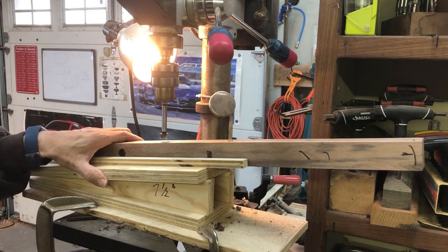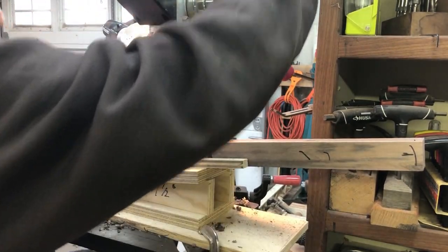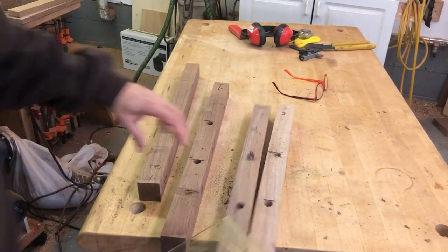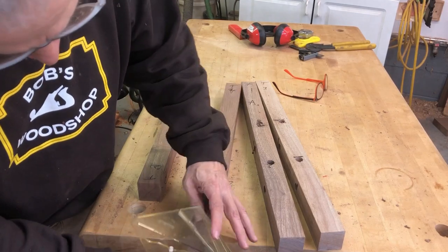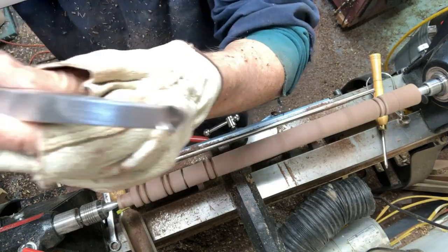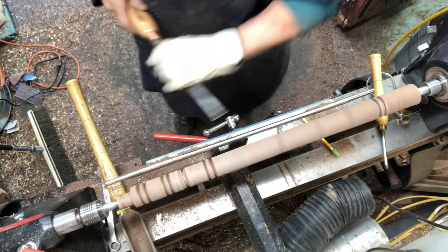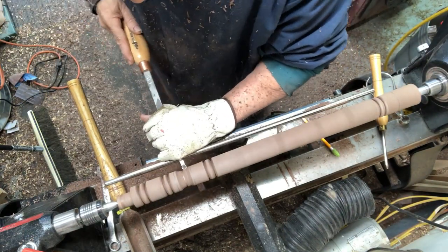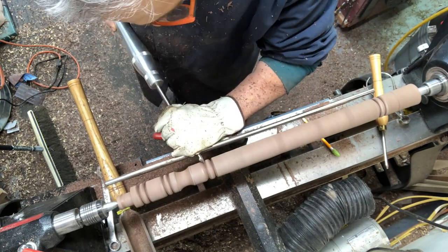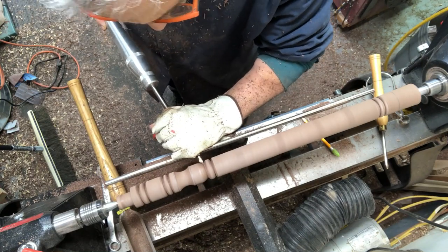Here's a little more of the same at a different angle. The use of a fixture like this is just the way to go — you get a lot more accuracy. The next step is to mark the center of each of the leg blanks, a relatively simple operation. From there I go over to the lathe and lay out the parts one by one. I made one sample piece and then transferred those lines to each blank — each one took me about 13 minutes to do.